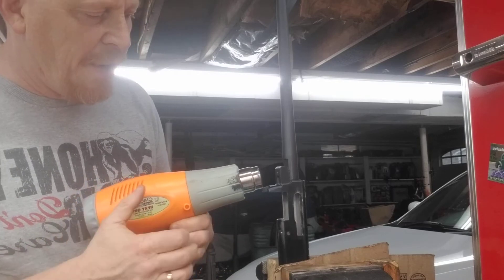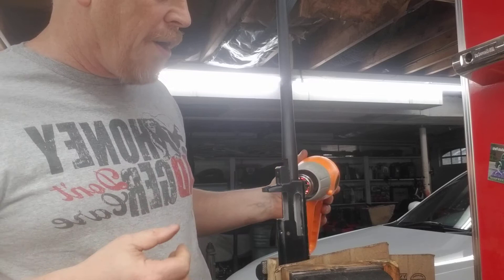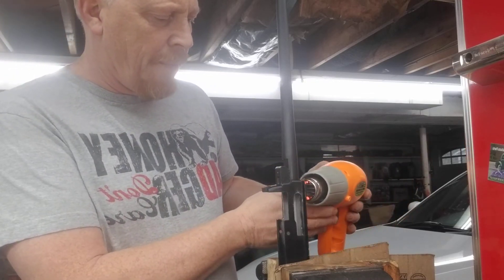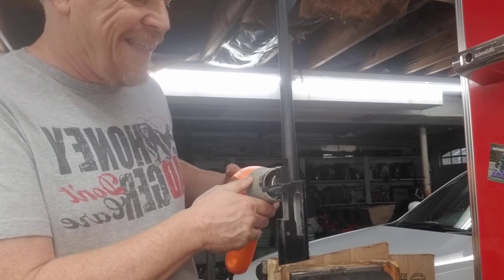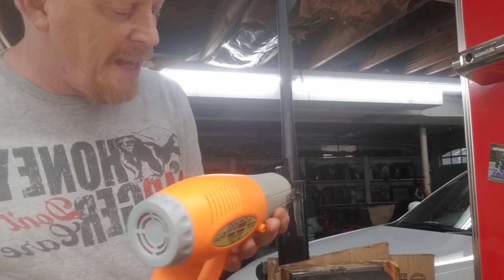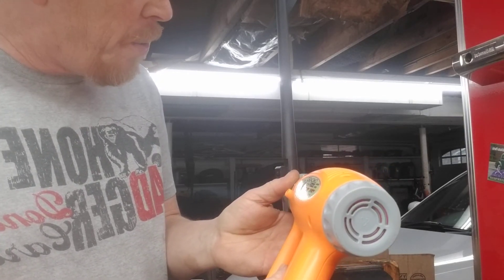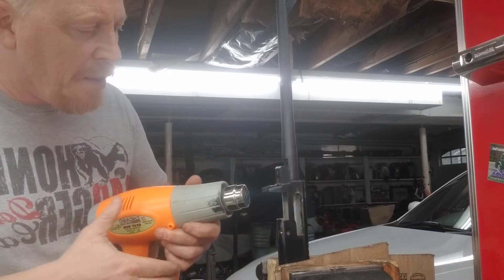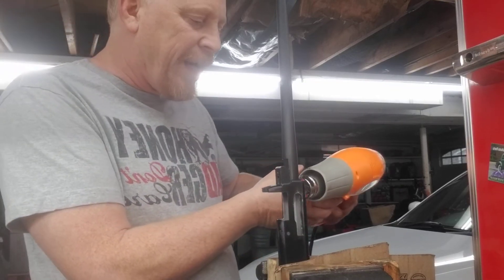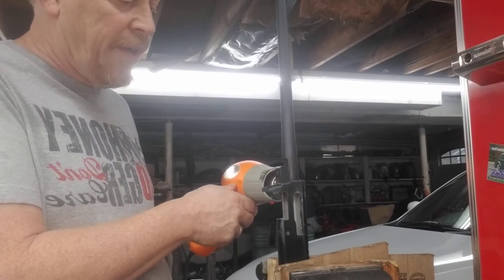There's no thumping, no beating, no dragging the barrel on — no hard steel barrel across the soft aluminum receiver. Why this works is aluminum expands twice as much with heat as steel. So yes, the barrel is going to grow, but the aluminum receiver is going to grow more. So eventually we'll get this hot enough and the barrel will just literally lift right out.